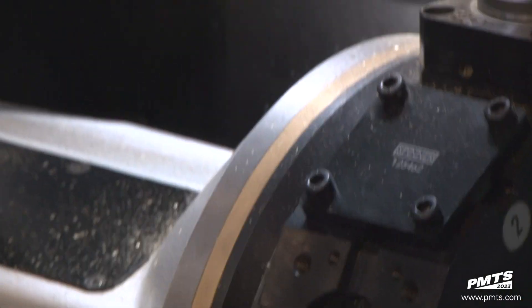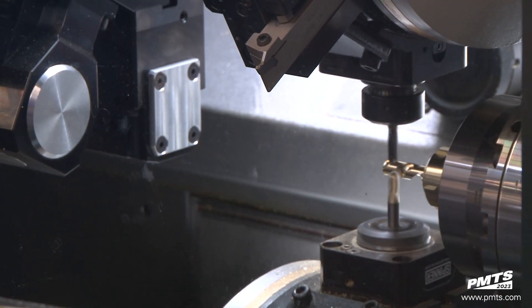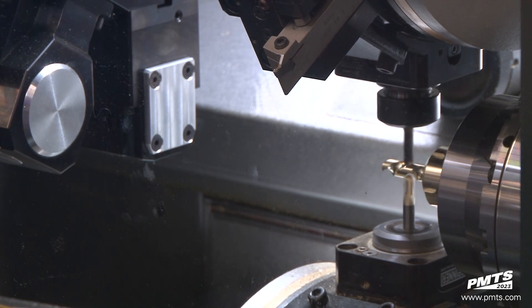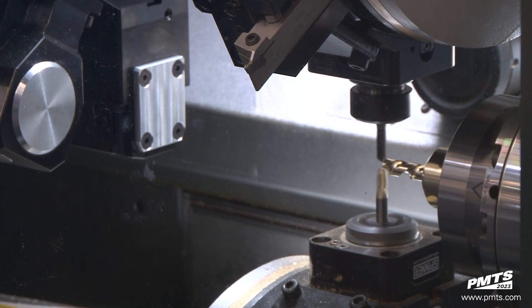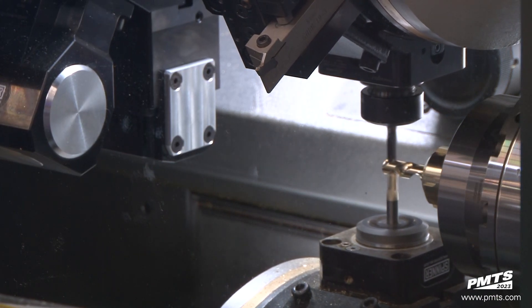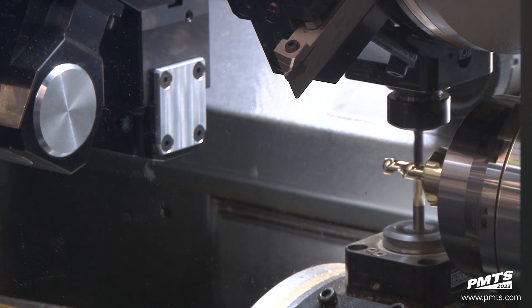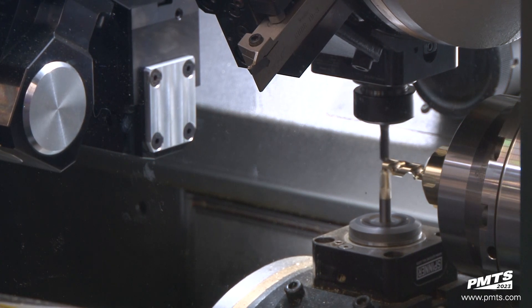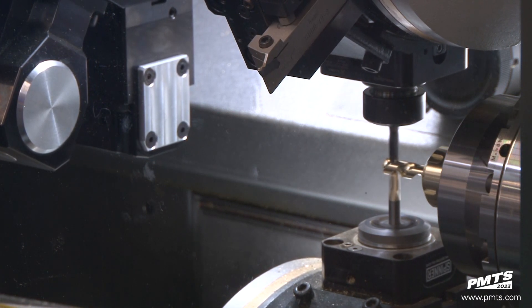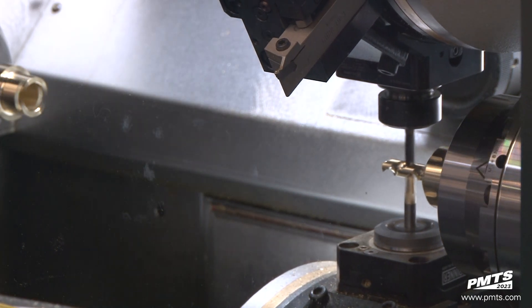Setups can also be a killer in most shops. With three turrets you have 36 stations for tools and the potential for double-sided tool holders in each of those stations. This means you can have redundant tools for long automated runs and resident tools for families of parts that share a single machine, minimizing setup times between jobs. The 90-degree bed also makes for a more ergonomic setup with less stress on the spine, as tools are right there in front of you and available for changeovers and maintenance.